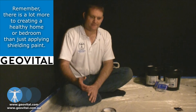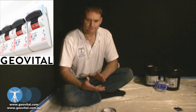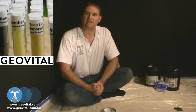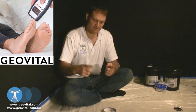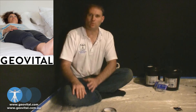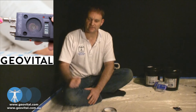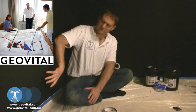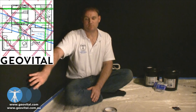In terms of the PowerPoint, which is the more popular option, there are two philosophies on that, and we have a distinct opinion on them. There is an accessory available called an earthing plate — a piece of metal with a number of screws that you attach to the wall. An electrical cable comes out of this plate with a power plug on it. Because you've positioned this next to a PowerPoint, once the job is completed, you can take this plug, put it in the PowerPoint, and it connects to the earthing in that PowerPoint.